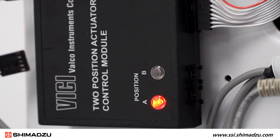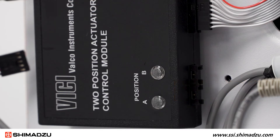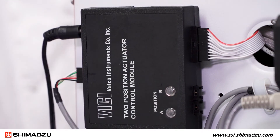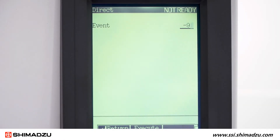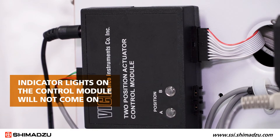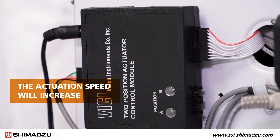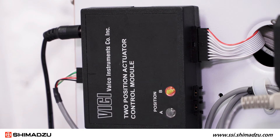In this case, we enter Event 91 on the keypad. The indicator light will go out. Reconnect the line between the valve actuator and the control module. Toggle the valve slowly between the load and the inject position. The actuation will start slowly and the indicator lights on the control module will not come on. After several rotations, the actuation speed will increase and the sounds will become sharp. The indicator lights will illuminate on the control module, alternating between the inject and load position.